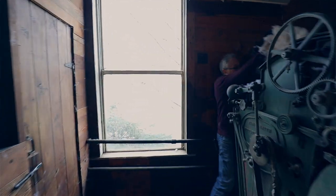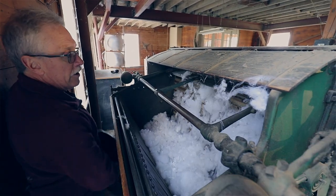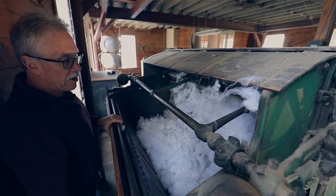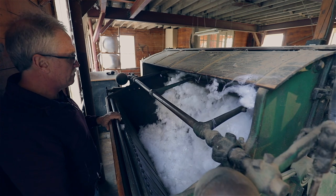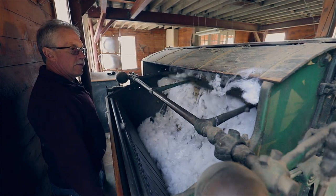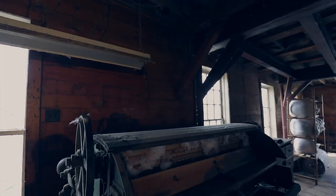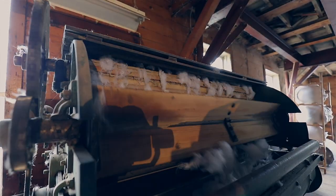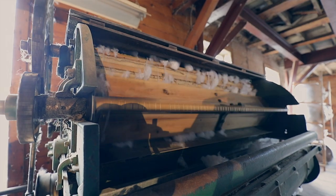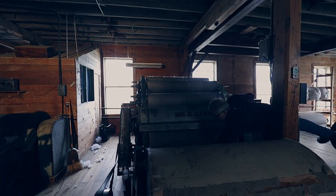Put it in the back hopper of the carding machine. The feed section was put on in the early 1900s, but this will grab the fiber, carry it up, and drop it down into the next apron, which pulls it into the carding machine. You'll be able to see it drop down into the next layer and get started on the drum.